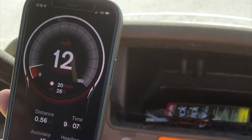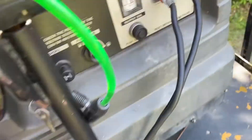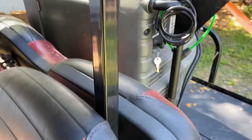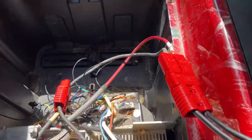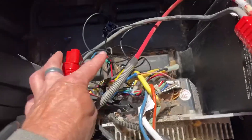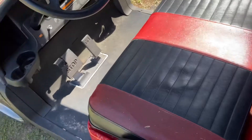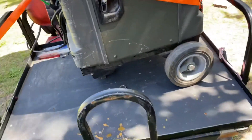There you go — your first hybrid electric generator golf cart. Just got out — we're going to feel the wires, and they're not warm at all. You can see the generator back there outputting a regulated 52.5 volts. Showing you again: this side is the battery pack, clearly disconnected — I'm going right from the controller into the generator. It definitely works. This could be a great solution if my batteries die or if I wanted to go somewhere really long distance — I could put the generator on the back.